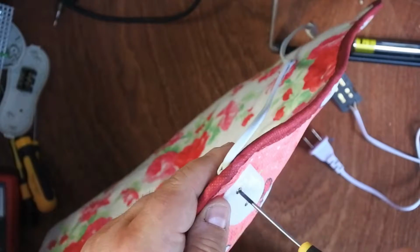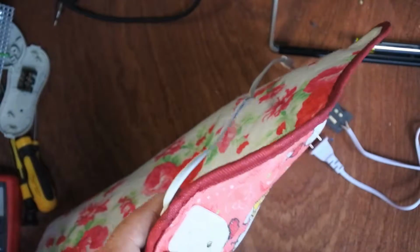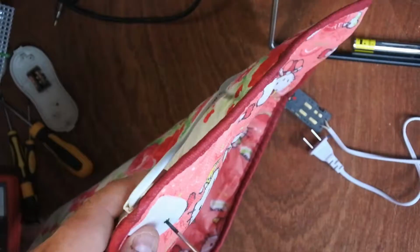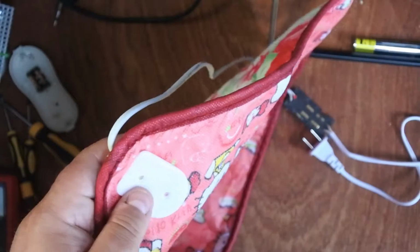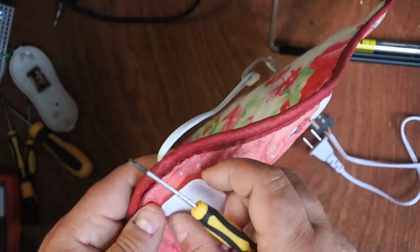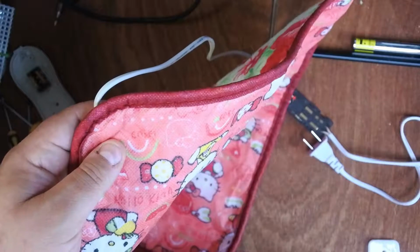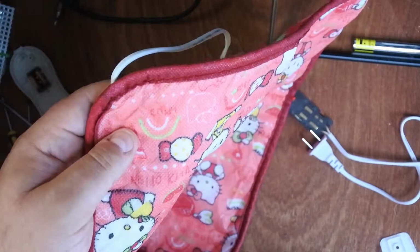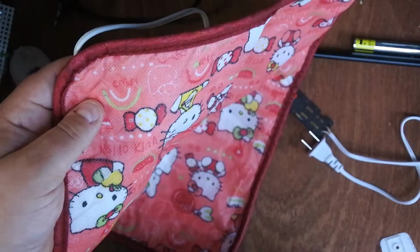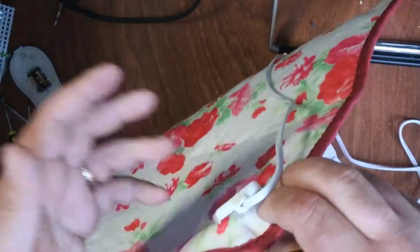Oh yeah, I was talking about electric blankets earlier. I keep calling them sleeping blankets for some reason. The way they're made nowadays is, instead of having mains voltage going through resistive wires, you actually have carbon fiber elements which can operate on 12 volts. And you'll have your carbon fiber heating filament, but outside of that you'll have two extra layers. One will be the feedback layer, and that's basically a material that changes resistance based on heat. So back in your control box in the lead, you'll have a bit of circuitry that measures the resistance of the detection wire, and if the resistance goes up or down beyond a certain level, they'll know that the filaments have overheated and to shut down. So it's a very safe way of doing things.